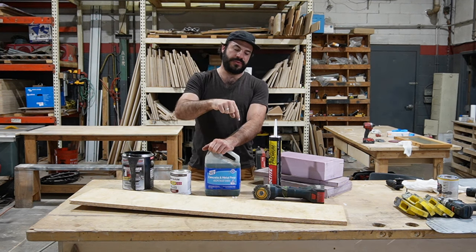Well, I think we got enough weight on here. So let's just recap what we've got going on. We've got our first course of our foam board, our second course of 2-inch foam board, and then finally our Advantech oriented strand board subfloor. And I've got literally about a ton of weight on this, but you really have to use that much weight if you want this to sit flat and squeeze all of the adhesive in. Maybe I go overkill on the adhesive, but in my view, you can't use too much of that stuff.